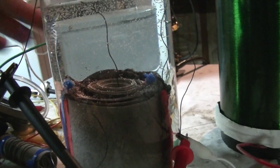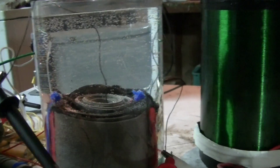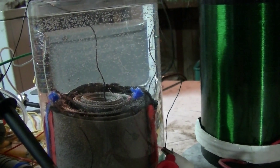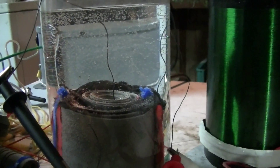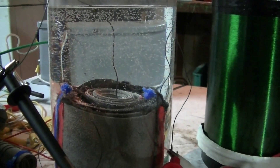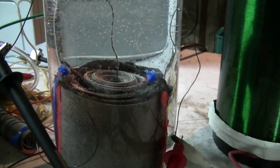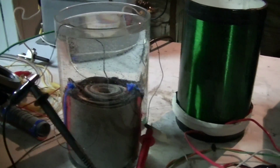I'm shaking the bubbles off so we can see actual production. I used nylon as an insulating membrane between the cells, and nylon is surprisingly expensive. Now we're starting to produce hydrogen — there's like a warm-up process where the water undergoes a dielectric breakdown. It takes a little bit of time. We're still at 100 milliamps, producing a very minute amount of hydrogen at about half a volt.